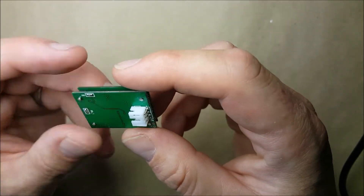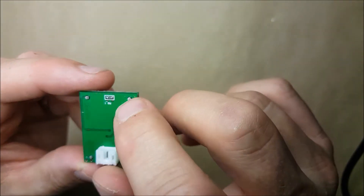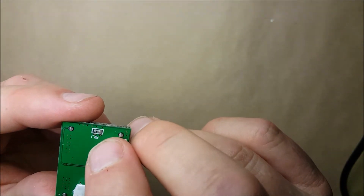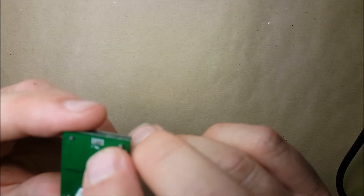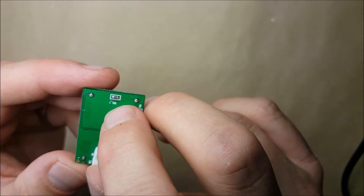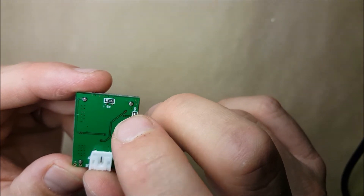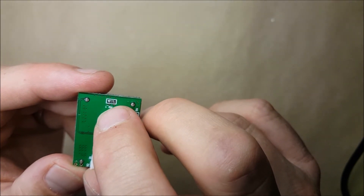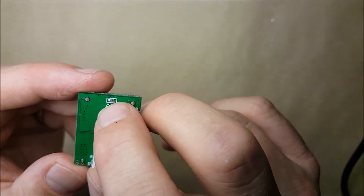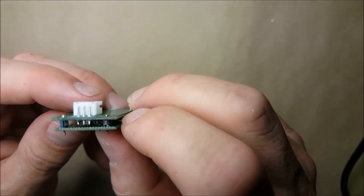So I'm going to get this one ready. A couple of modifications I'm going to do: the first thing is, if you look at the back of it, there's a little resistor. It comes fitted with a resistor and it gives it a range of about seven meters. I don't have any rooms in my house that are seven meters in size, so I'm going to replace this resistor with a variable resistor that will give me anything between basically zero and 100k, meaning I'll be able to adjust the sensitivity of the device.